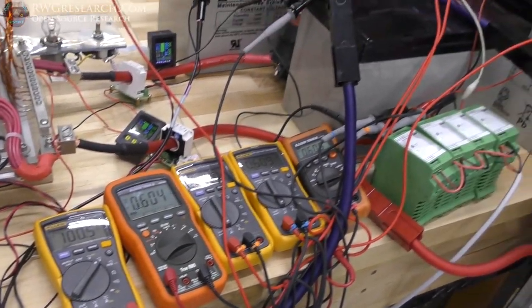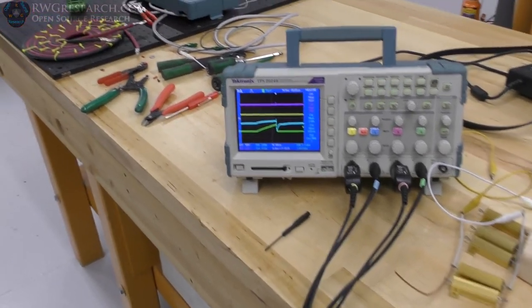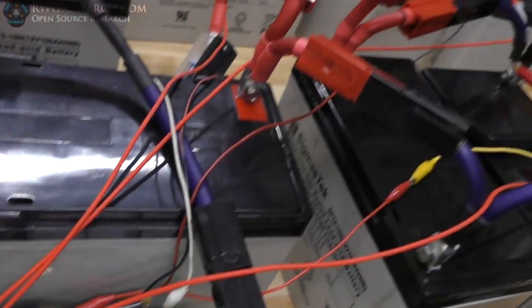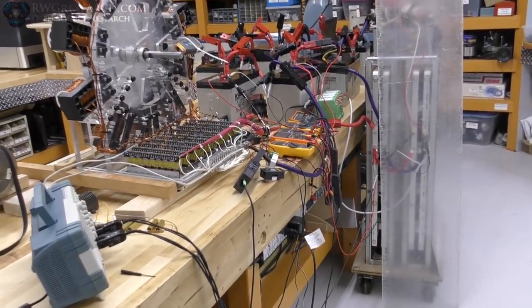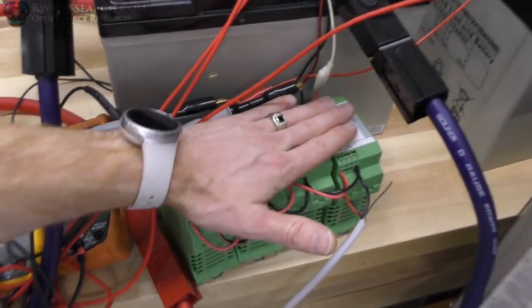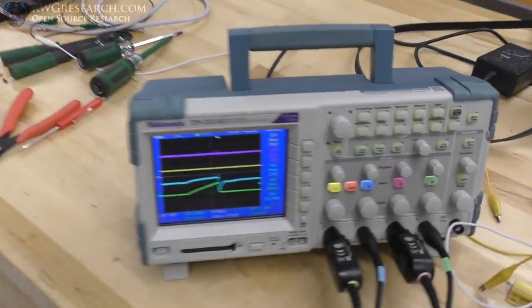You've got to do 25 volts, you've got to do each bank, do all the calculations — it's a bit tricky. From my understanding it is not gaining, but I really don't know. I didn't give it a chance to get high — once this voltage gets up to like 230 you can let it sit. I have the flyback charging the cap bank, going into these isolated DC-DC converters, all running to each battery bank and truly feeding the energy back into the system. It's a challenge to get a looped system without ground and power problems. These power supplies do a good job but at only 88% efficient they get pretty hot — you'd have to calculate all that heat loss.